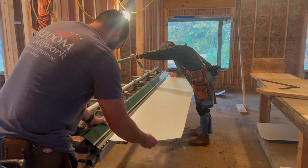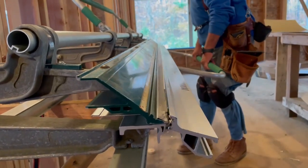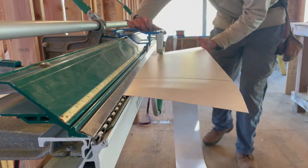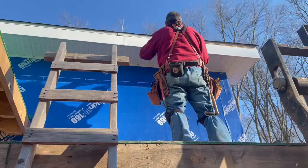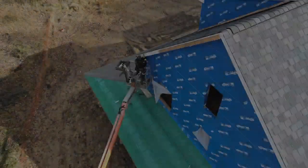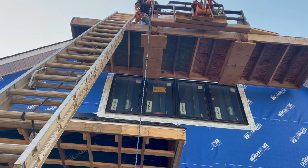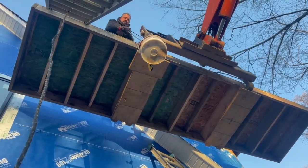To properly install the metal cornice, we had to bend the metal on what's called a brake, which bends the metal to the dimension we need. Smitty gave me lessons on how to bend the hem and overhangs properly — I had never used one of these brakes, but I had to learn quickly. Smitty placed himself on the building to install, while I was in charge of bending the metal and delivering the proper lengths. We delivered tools and materials up to him using a rope fishing line — simple but effective.